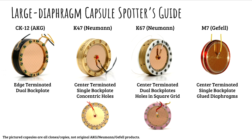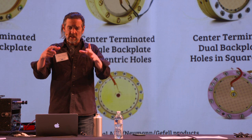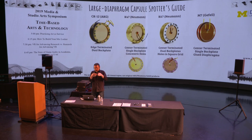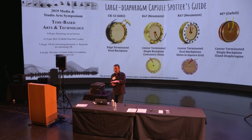The way these are made: there's a piece of brass that's the back plate, and they lay the diaphragm on — it's been pre-tensioned — then they put a ring on top and screw it down to hold it in place. It's not like a drum; you don't tune it by turning the screws. The M7 is really interesting in that it's glued on. The mylar is pre-tensioned, laid on top, and then you put pinpricks in it and a tiny micro-drop of crazy glue inside. There are little grooves that go around the circumference, and the glue sits in that little trench and holds the diaphragm down — if you're lucky. If you mess it up, you scrub it off and start over.